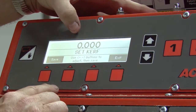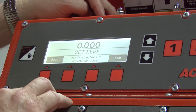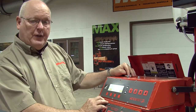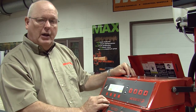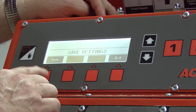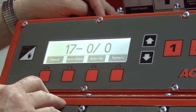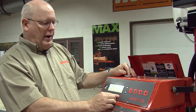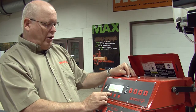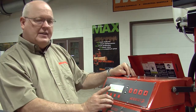The default setting is zeros. If you are using a forty-five thousandths blade, you're going to set this to point zero nine four. And if you are using a fifty-five thousandths blade, you're going to program this to point one one zero. You will then save the setting, and the save button will come up again. You can program your patterns all sixteen at one time, or your auto-downs all sixteen at one time, and only then save it once.